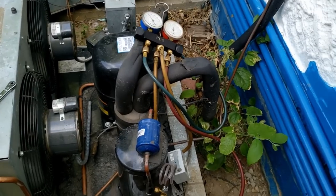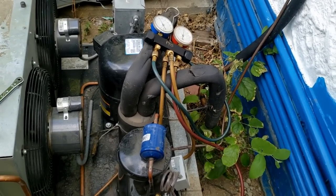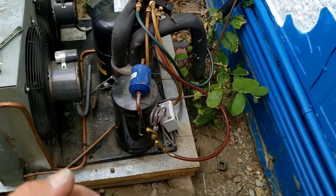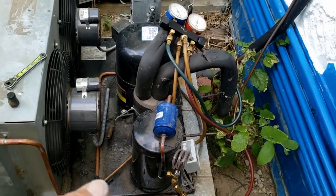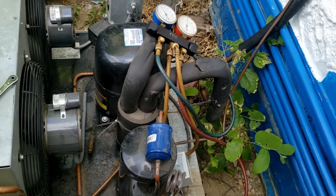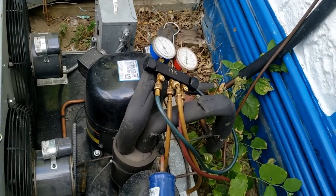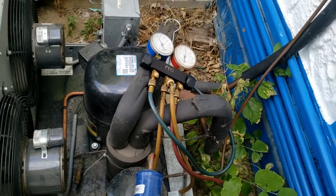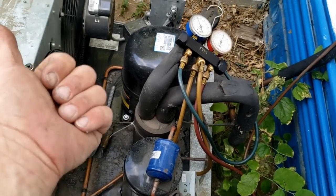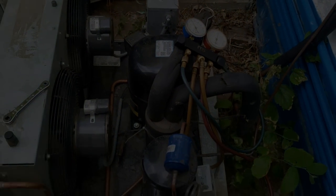If I'd put nitrogen in it, it could have contaminated the whole system. The system was dry and clean to begin with - we opened it up for a split second to do a repair and put it back together. It isn't like it rained inside of it. Some of this stuff is a little hyperinflated as far as the procedures we do. I have no problem doing it perfect on a brand new system, but on some of this repair stuff it's just not logical or feasible. If you guys like the video and want to see more, give it a thumbs up, like, share, and subscribe - until next time!